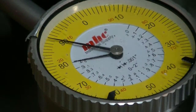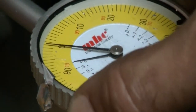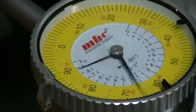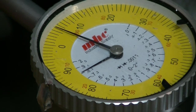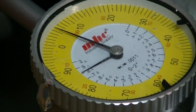Now what I do is release my table. I set it for my zero because this is now my base of cut - you'll get the parallax effect viewing on an angle. Now I have to move it one hundred and ninety thousandths. I'll go one hundred and ninety-five and lock the table. My table locks a lot neater in this direction - it only moves about one thousandths when I tighten it up. When I move in the other direction on the Y axis and lock the table, it moves about five thousandths.